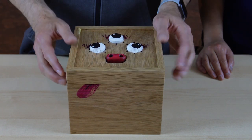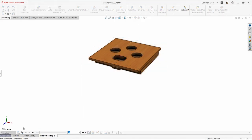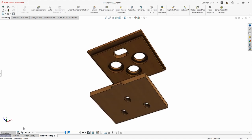Let's jump into the build so you can see how we made it. I really love making simple boxes like this, and I enjoy adding special touches like we've done here. This box has two unique wooden pieces that make the combination lock work. The upper piece holds the locking knobs, and the lower piece slides to engage the locking pins. I focused on making these parts first.